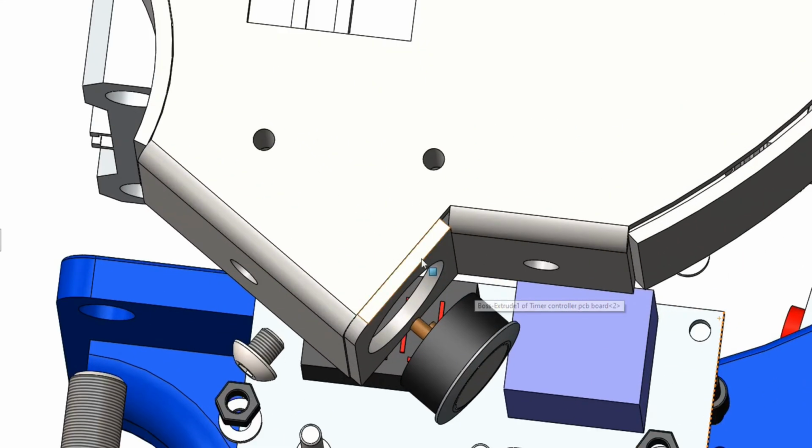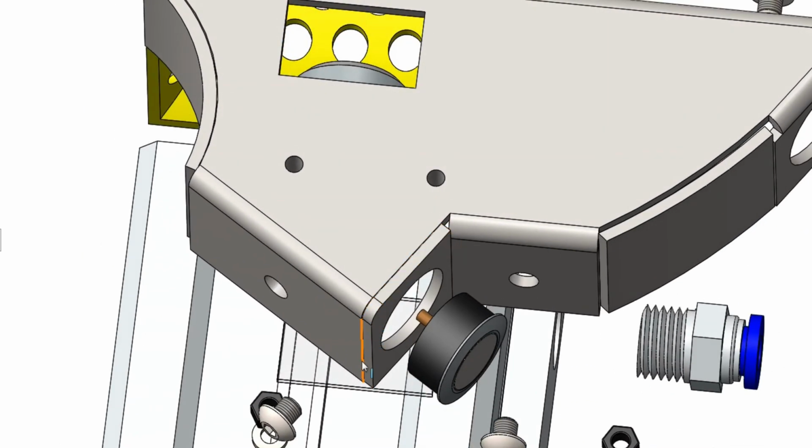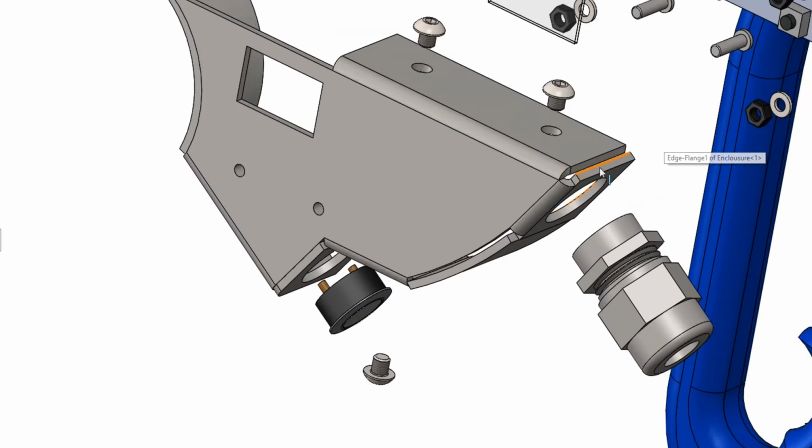There we go. So there's the wee pieces here. This wee bit with the switches here is TIG welded down here, and it is sanded and polished. This cover is not purged like the enclosure because it's not required, because you're working off the edges. When I weld, this is going to be a good fillet weld. The enclosure is different. You don't want to be sanding through the holes at the corners of the enclosure where I set the pieces in. So it's a bit hard to explain that, but this is welded down here with the TIG, and down here and down this face, and also down here along this face.